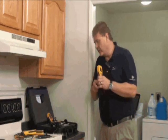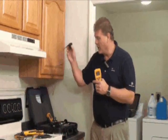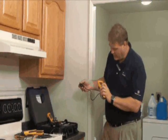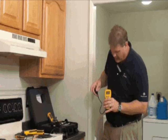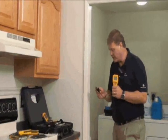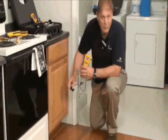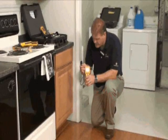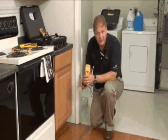We also have the pin mode and the non-invasive mode. With the pin mode, you can use this plug-in heavy-duty moisture probe. You can see if I put my fingers across the probes that we get a reading here. You would use the pins in materials like wood flooring, drywall, brick, or plaster to give you a value of moisture content or wood moisture equivalent on the instrument. It also has an audible, so if you find excessive moisture, you'll hear a bleeping.